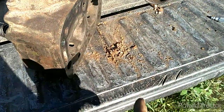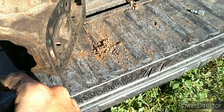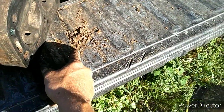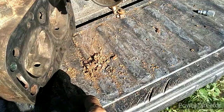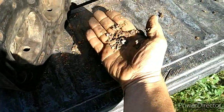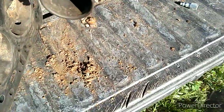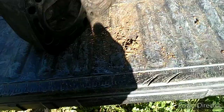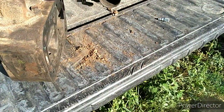I'm going to clean some parts for the 4440 and I gotta bring Tyler's head outside. I stuck the air hose down on each side and stuff came out - this is what just came out of the exhaust port. I had the air blowing in on one side, pushed on the valve and opened it up, and all that crap just poured out. Pretty much as soon as the valve started working, this stuff just started raining in and causing havoc. I can't believe how much rust came out of that manifold - but I don't know how long it's been sitting.